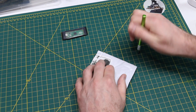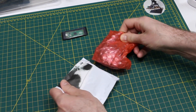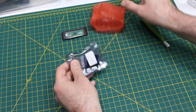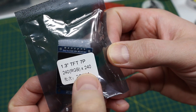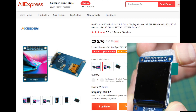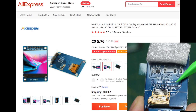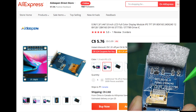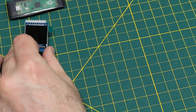This one has a description using characters I can't read, so I will have to figure it out empirically. A TFT display! 240 by 240, 1.3 inch. I thought this display might be interesting to use instead of those regular tiny OLEDs. It uses the ST7789 driver chip, so I'll have to figure out how to use that with Arduino.